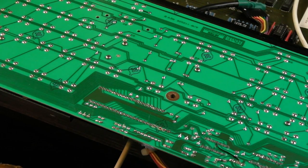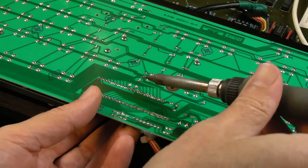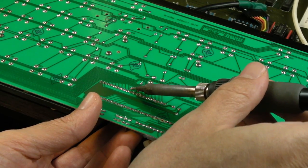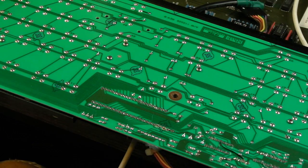Right, intermittently working, and I thought maybe it's a clock thing. That crystal on the other side feels really loose. So I reflowed this pin. Pins reflowed nice and fine. This pin here, oh hang on a minute, where's the pin moving around? It's come off the oscillator. This is, I think, his issue.